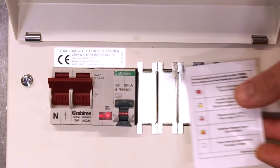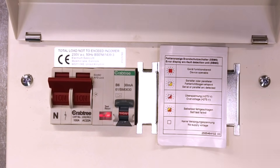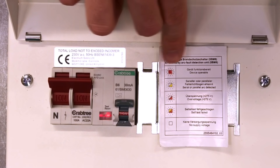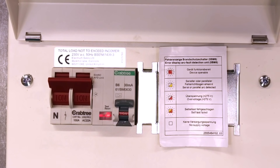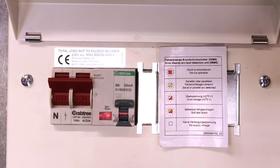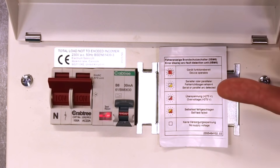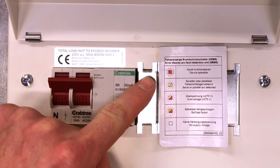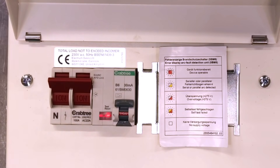That red light is actually correct. Looking at the manufacturer's instructions — there's a sticker you can place on the board for the consumer — a solid red light at the top of the list means the device is operable: everything is working fine with the AFDD. Other indicators use dashed lines on the symbol suggesting flashing lights for fault conditions. If a serial or parallel arc is detected, half the window will be clear and half yellow — believed to be a flashing yellow light. This is a radial circuit so the device will pick up both serial and parallel arcs. Ring final circuit limitations will be discussed in a separate video.